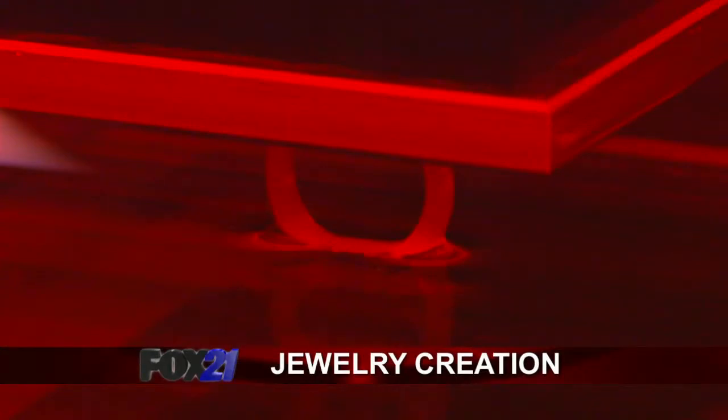And that's what this does right here. It's a rapid prototype machine. What it utilizes is liquid resin that is photosensitive. So when there's a laser in there and when that laser hits that resin, it starts to solidify that resin in just that spot. And then layer by layer, it puts together a ring. This is pretty cool technology, and this is fairly new.